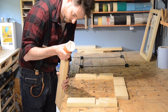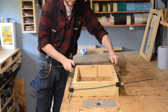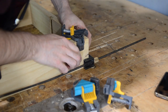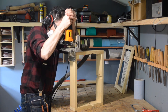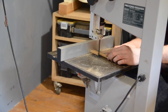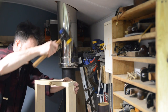Now I can get the box put together. I'm going for something very simple and we're just going to butt joint this. I'm then going to come back later and reinforce all these joints. To hold it all together I'm going to use a combination of clamps - the Veritas clamp on the bottom and these Wolfcraft spring clamps at the top. When it's all dry, I can come back and use my dowel joiner to drill down 40mm into these corners. I'm using this machine because I have it, but a drill and a steady hand would work just as well. I had some oak dowels at 12mm so I'm just cutting these down to about 45mm, then I can get some glue in the holes and get them tapped into place. These protrude about 5mm and I just sand them flush when it's dry.